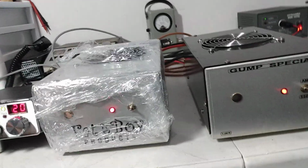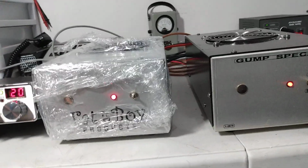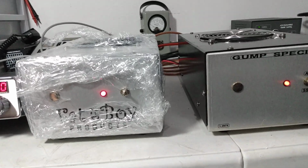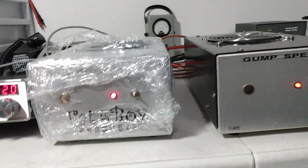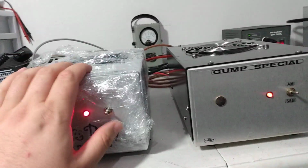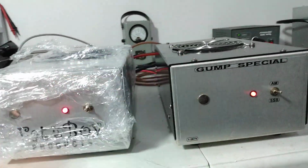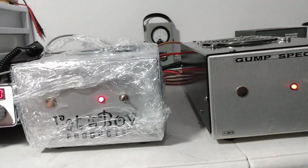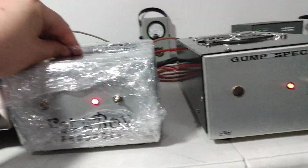Doing a good job. Usually what they do, somewhere between 800 and 900 watts. Occasionally you'll see one do a little bit more, but good running little amp here. Should do you a good job. 65 to 70 amps draw with the amp and the little driver. Drive it less, going to draw less power. Every radio is different. Every setup's different.